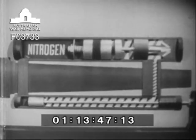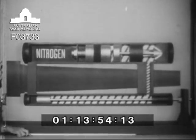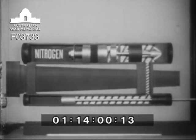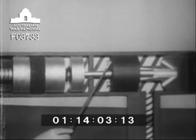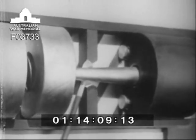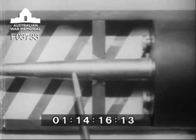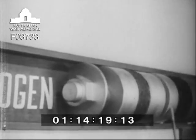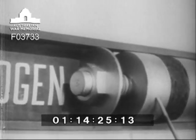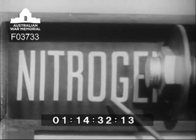When the weapon is fired, the cylinders are driven to the rear with the howitzer. The piston rod is fastened to the cradle and remains stationary. So the rearward movement of the cylinders forces the oil ahead of the piston, through the ports in the front yoke, into the counter recoil cylinder. Here, the oil is forced through one-way valves, and next through a throttling ring. The diaphragm, pushed back by the in-rushing oil, pulls a tapered control rod back with it, gradually closing the facets through which the oil is flowing. The oil that gets through presses the diaphragm back against the oil reserve and the floating piston, which can only move back by compressing the nitrogen gas. In doing so, the remaining energy of recoil is finally exhausted.